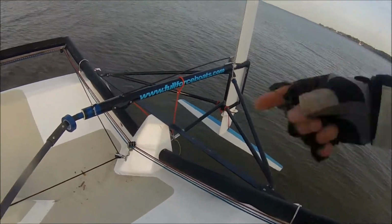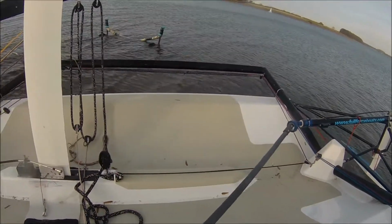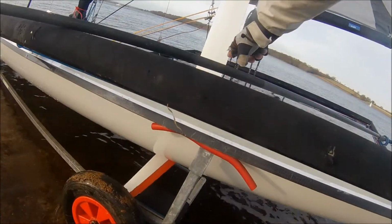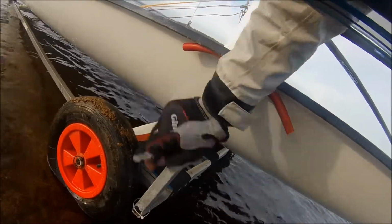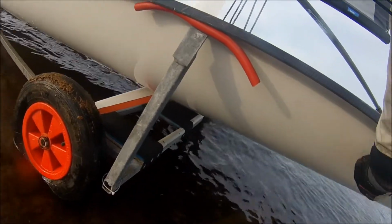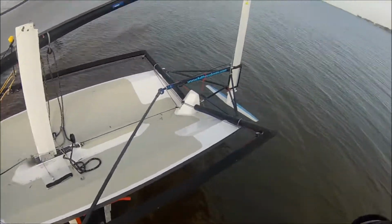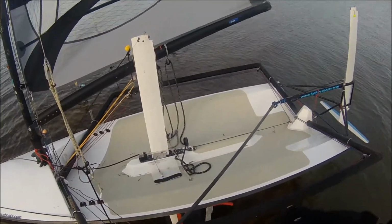and the difference between the A and B measurement, the A measurement being the distance between the leading edge underneath the hull, which is just there, and the leading edges of the foil at the bottom end. So you measure the two angles, and the difference should be 162, and this is set up on 165. So 165 should mean that it flies.